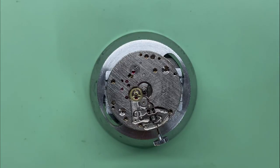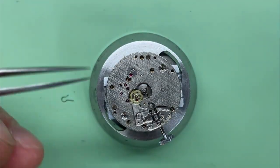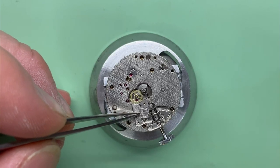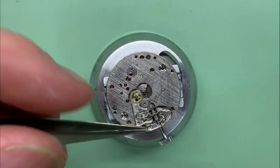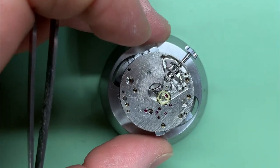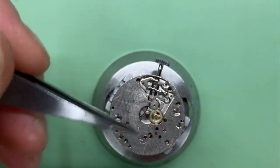And then we have that really horrible little shepherd's crook spring, one of these. Never particularly fond of these. It's got a nice part that it's going to secure around there. Now normally with these sort of things, I've found get the short end in and up against the long part, or the recess where it's supposed to sit. Be careful, because obviously these things have a tendency to fly.